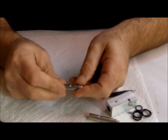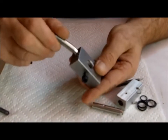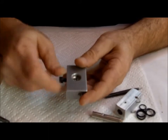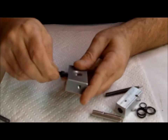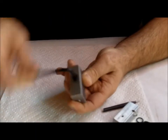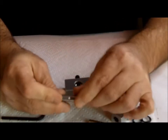And you can see you got a nice hole there. Now what I do then is turn it around opposite way. Yep. Drop it in. That's a nice punch. Screw it in until the pin hits the side. And again. Just make sure you note where the handle is and go two full turns. And that's what you're left with.